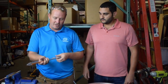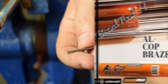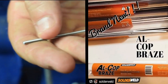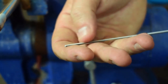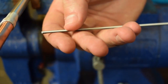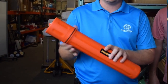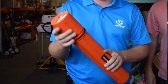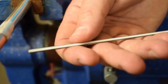Let's get a close shot of the rod itself. If you look closely at this rod you can see there's a flux actually laid into the channel. This is what we call a flux channel rod. What's nice about that is you can lay it with the flux side down so that the flux is allowed to wet the copper and aluminum and absorb or eliminate any of those oxides that would normally prevent the solder from flowing. Another nice thing about this flux is it's a non-acidic flux so it doesn't need to be cleaned and it's not going to corrode the copper or aluminum, although I still prefer cleaning it when I'm done.